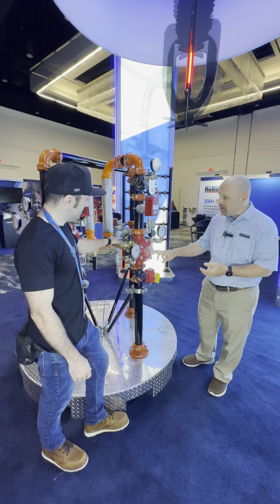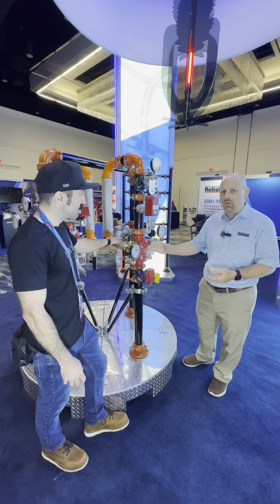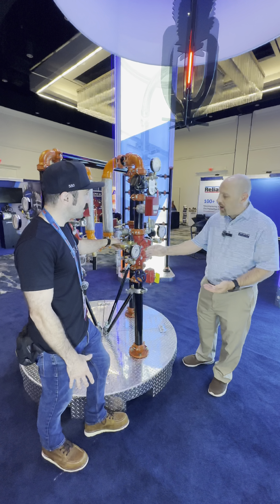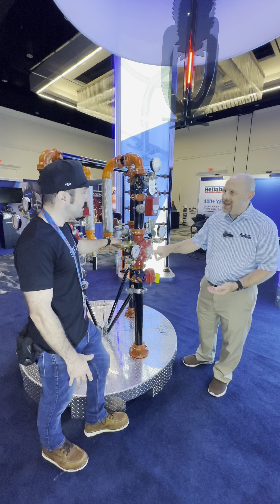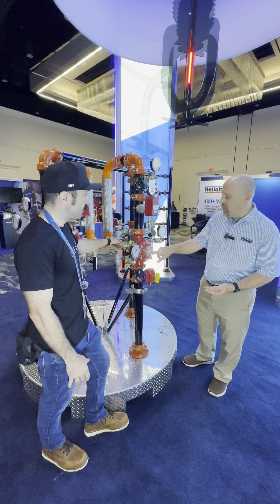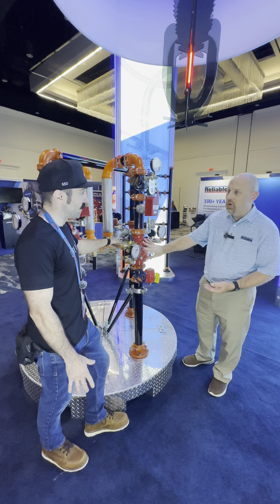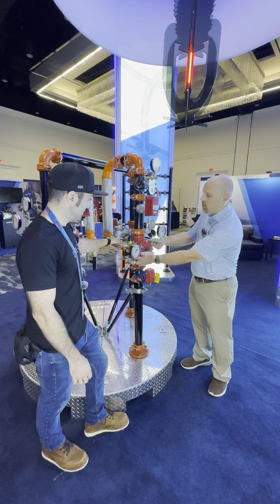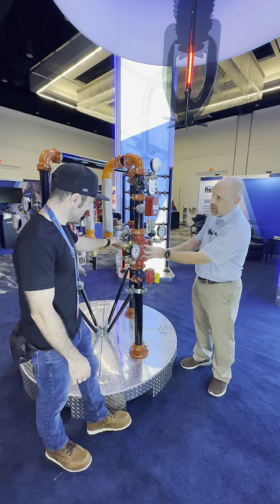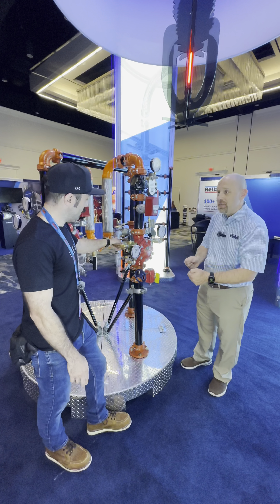So that's a nice selling feature. Now, another thing — this is a diaphragm valve. There's one rubber moving part; it basically looks like a bowl, and it's filled with water right now. Normally all the competition has these trim pipes that go through the cover plate, which makes it hard to get in and do your maintenance. Our stuff goes through the back — there are channels in this cover plate, and we can actually introduce water and let water out, and you can still get in and do your maintenance.